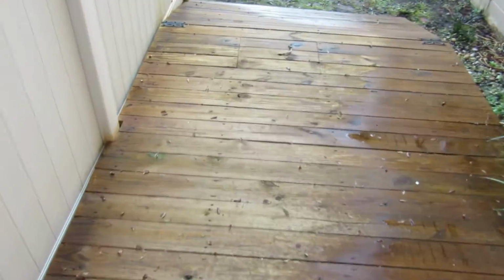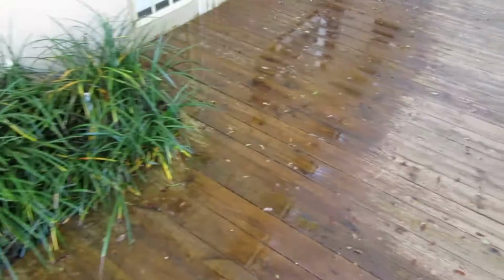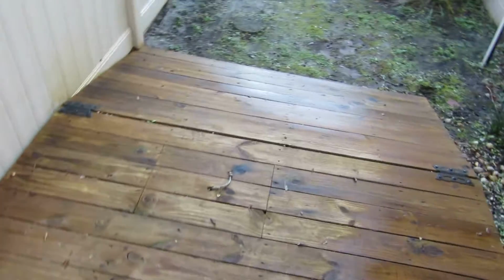It's also the lazy stain. You can literally just spray it on and walk away. Oil-based stains and sealers penetrate real well. You don't have to do anything to them. It's real unforgiving at first, until you see, a year down the road, what it really looks like.